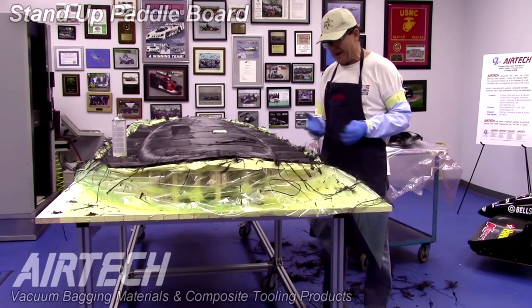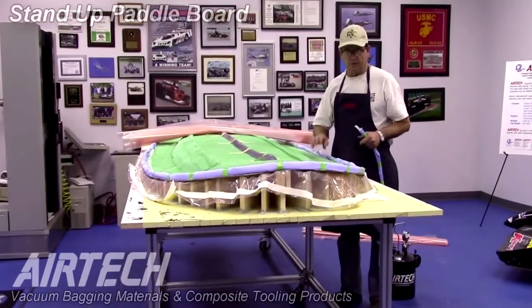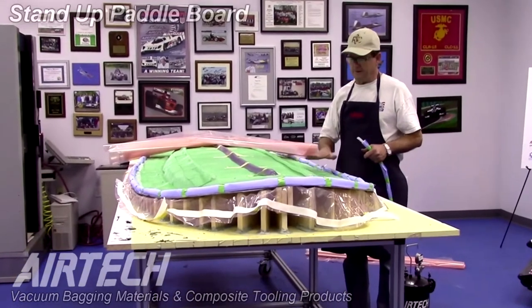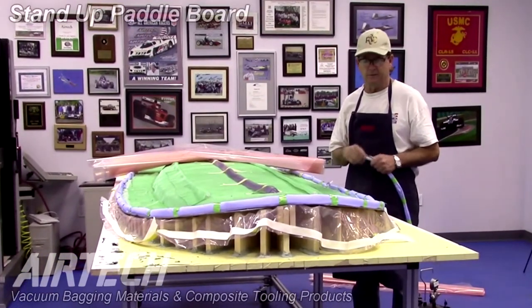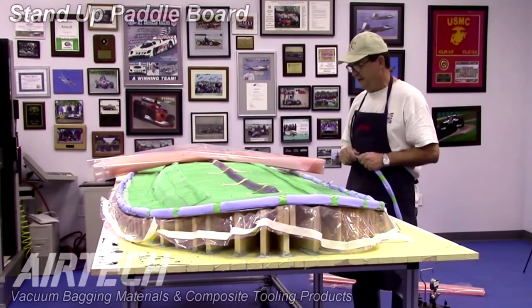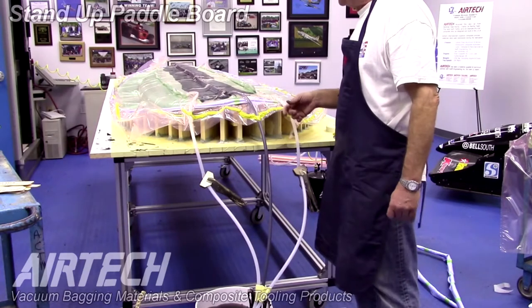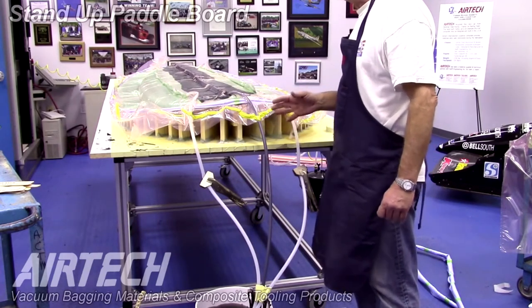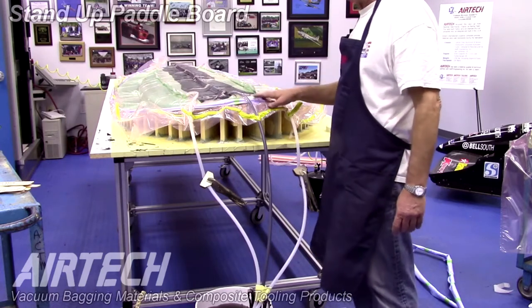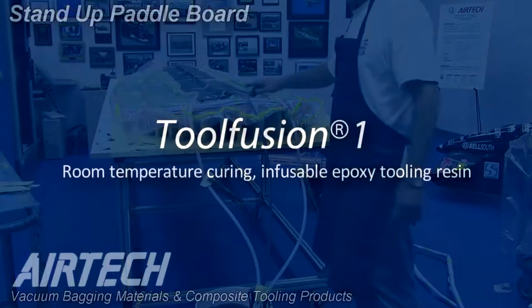Release films, bagging films, breathers — they do stretch, but I prefer not to rely on that. Surface coat applied. We laid out our 3K, 12K laminate stack — rather, fabric stack — with AirTac 2 light spray contact adhesive. Temperature conditions: 72 degrees F, 22 degrees C. The real benefit is it cures at room temperature. Obviously we'd have a hard time getting this board into an oven. The other thing is I have a foam core.